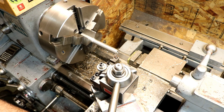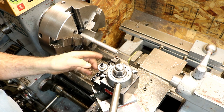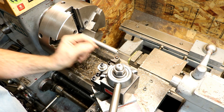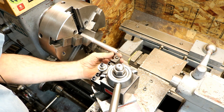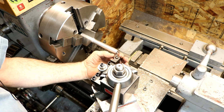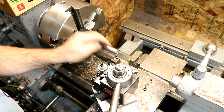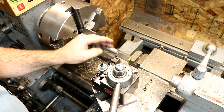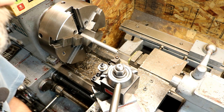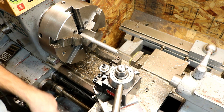Or if it's an intermittent cut — now you can do intermittent cuts, but you've got to take it easy. And different carbide hardnesses: whether it's a C5, C6, or a C2, the lower numbers can usually withstand shocking pressures a little bit better than the higher numbers. But they're designed to cut, not designed to back-drag.